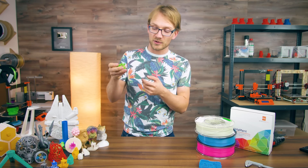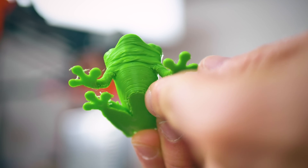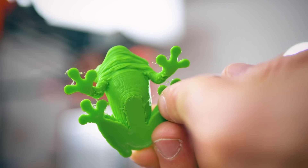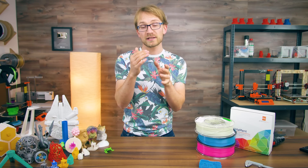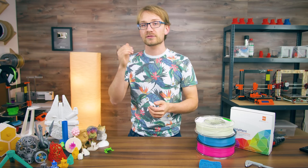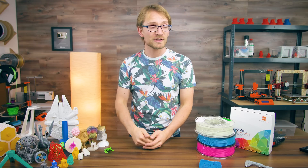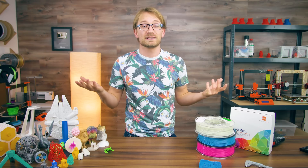If you're seeing curling or melting artifacts, first try increasing the fan speed to full blast after the first layer, but if it's already at full speed, you need to either slow down the print or reduce temperatures. Slowing down a print is almost a universal guarantee for better prints, and it's no shame to drop down all the way to 40mm a second. Most printers claiming much faster speeds won't reach them anyway because they just can't accelerate fast enough.